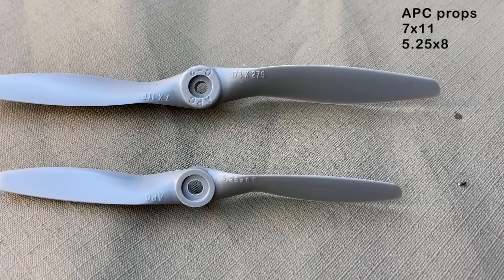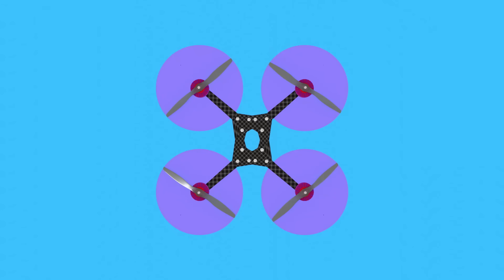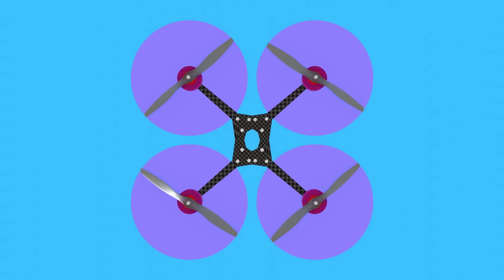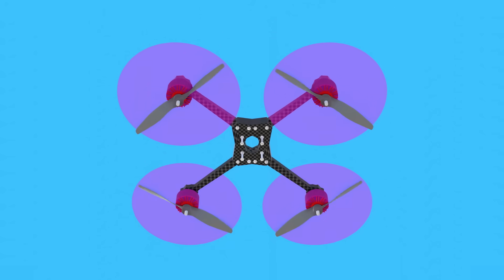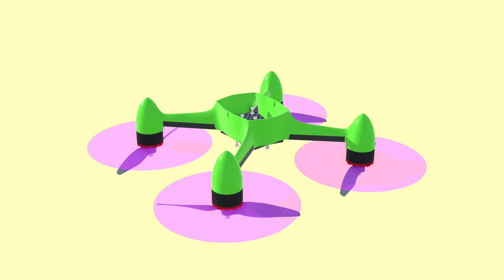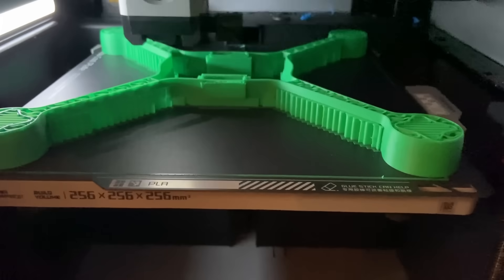The question was how long to make the carbon fibre arms. We had just two options of extreme high-pitched props. The five-inch ones would spin so fast their tips would go supersonic, so we went with the seven-inch. A bigger frame meant more drag, so bunching the props close together made sense. But the instability forces at such high speed are huge. Longer arms would allow the motors to run closer to 100% during the speed boost because less differential thrust is required to maintain directional control, and the props would be working in clean air.